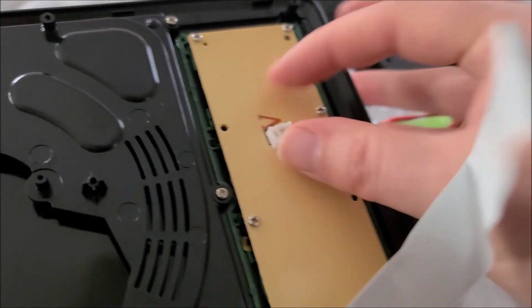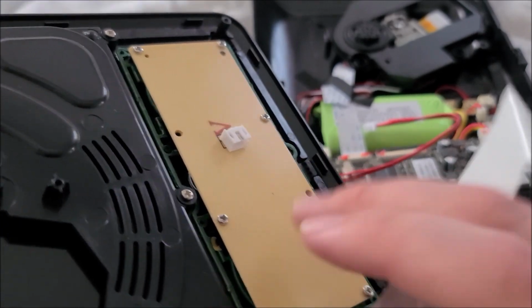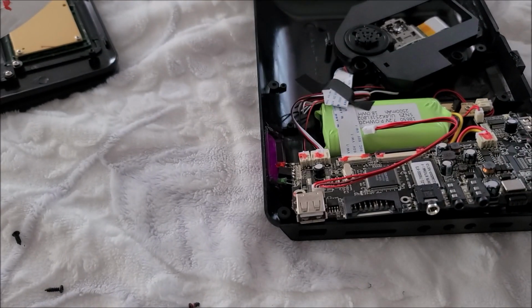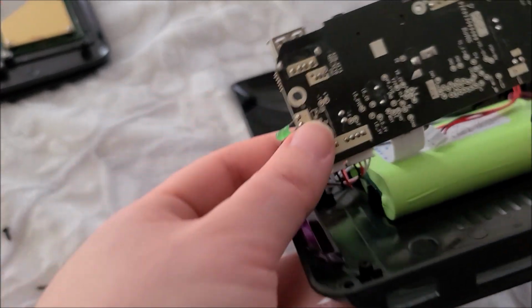So all these buttons are actually driven off of an analog, like, resistive divider. That could be an issue in the long run. There definitely are issues where if the buttons start getting oxidized or the connectors that connect the wires to them, it'll send the wrong voltages when you press certain buttons and it'll mix up the functions. It'll basically confuse the controller. And so I've definitely seen that.